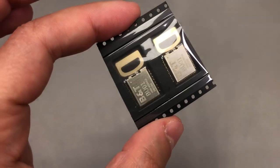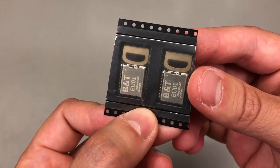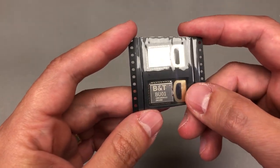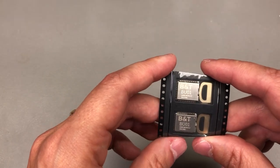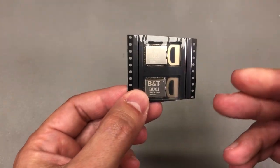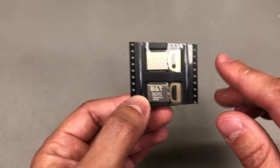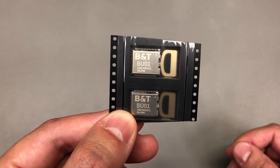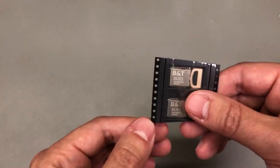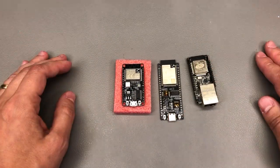Next up I have a couple of interesting modules which I've had for a while but never got to building anything with them. These are the BU-01 Ultra Wideband Modules, based on the Decawave DW1000 chip — a single-chip ultra wideband transceiver capable of two-way ranging and location tracking down to a precision of 10 cm. They're not exactly cheap but not expensive either, given the fairly limited market for fully integrated ultra wideband modules. These can really help you build a product without having to deal with complicated RF design. Check out the links I'll place in the description below.